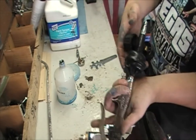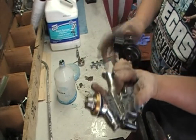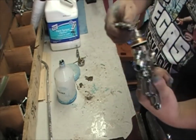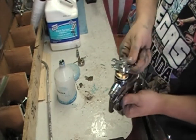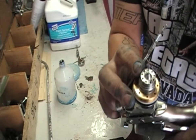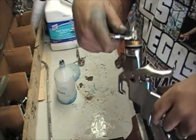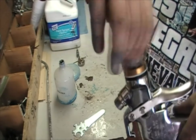Then we get back to the regulator on there — this is going in the garbage anyway because it's just crap. Don't buy certain things from Harbor Freight because it's just complete garbage. So throw that away. Get the Teflon off of there. Then find the right size on this wrench — it looks like it's saying 19, so 19mm — and unscrew this. When I bought this gun, this tip was really, really tight and I actually had to put it in my vise and crank on it to break it free. Luckily I didn't damage it. If it is tight, don't worry, that might be normal. Anyways, unscrew that the rest of the way by hand and there you go.